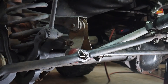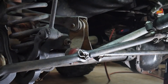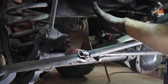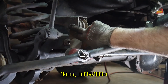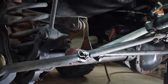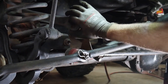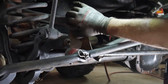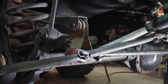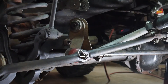With that out of the way, we're going to go ahead and disconnect this upper control arm and get it up out of the way. This bolt here is typically three-quarter, and depending on the year of Jeep some of these bolts will vary. This bolt here is 15/16ths and it has a T50 Torx on the other side. Once you get into some of the newer years of TJs you'll actually have a regular bolt, and typically it will have a little tongue on it that'll catch down here to try to keep it from spinning, but often times those will just spin.